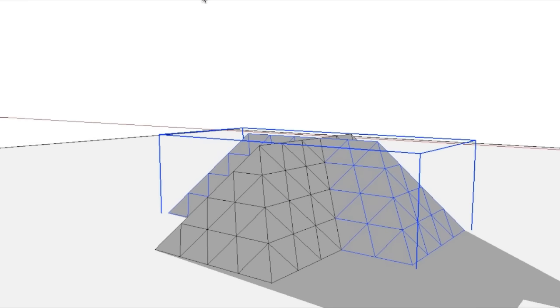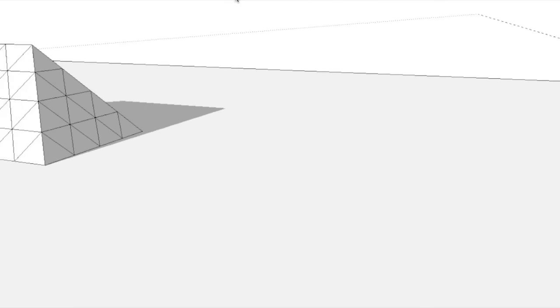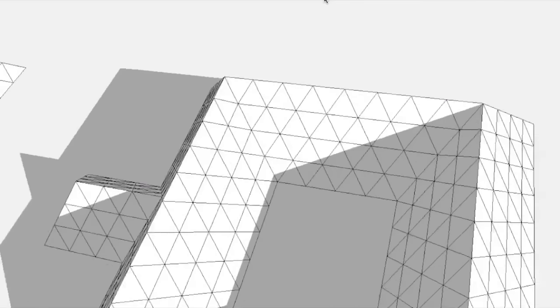I'm just using the basic concept to make a simple structure like this first. What I'll do is build this, test it out, see how it goes together. Obviously this line here, all of these are 180 degrees, so they're all square because they're all flat. But this line here, we're going to need a dihedral angle of some sort. And we'll also need an angle on the base. So something has to be angled just to allow for these to join together. On the basic dome that I'm building, I'll work that out and fine-tune it. And then from there on, I can start to build bigger, more complicated structures like that.